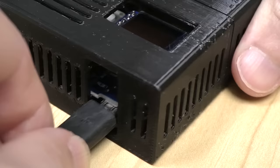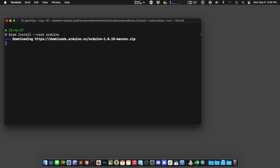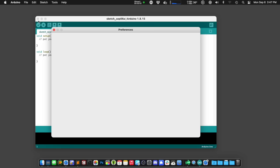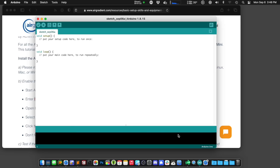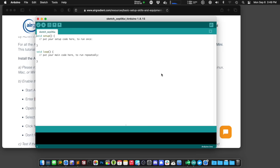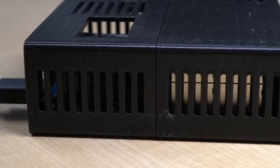At this point we have a glorified sensor package, but when I plug it in nothing happens — that's because the Wemos D1 needs to be flashed with software to make it work. The easiest way to flash the D1 is using Arduino IDE. I installed it using Homebrew on my Mac, but follow the official guide for whatever OS you use. Next, I had to tell the IDE to work with the D1: inside the IDE I opened up Preferences, added the ESP8266 to the additional Boards Manager URL, then opened the Boards Manager and installed the latest version of the board. Finally, I had to go to the ESP8266 menu and choose the right board version — in this case the Wemos D1 Mini. If you want, you can upload a blink sketch and watch the little LED on the D1 blink to make sure things are working.